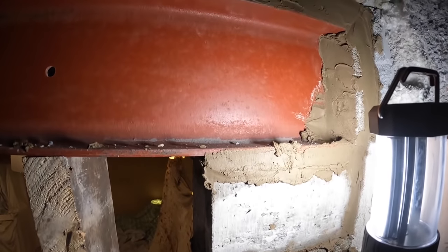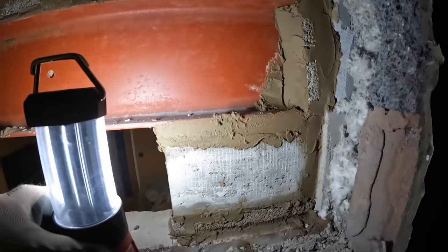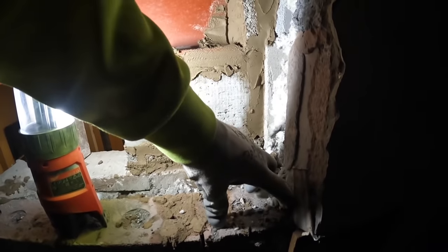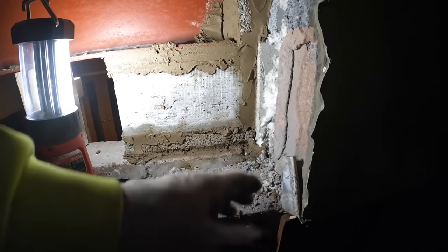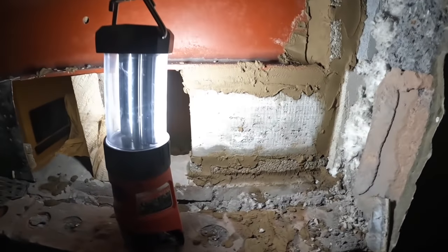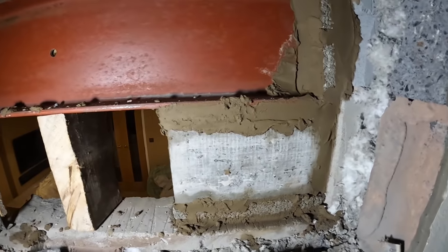So anyway, I've covered this end up for the night, and this end has pad stones in. It's 250 seating on the inside because it hasn't got a piece of timber coming through here. The wall plate's coming in here and sitting on there to do away with the pillar. So the roof sits on the actual house, so we got rid of the pillar. Again, 150 chopping down, coming out in line with that basically. So that's ready, that's all pointed up, ready for tomorrow.